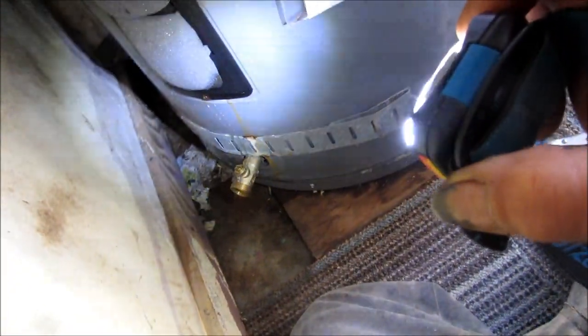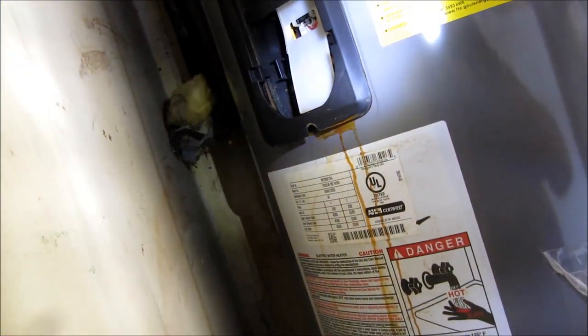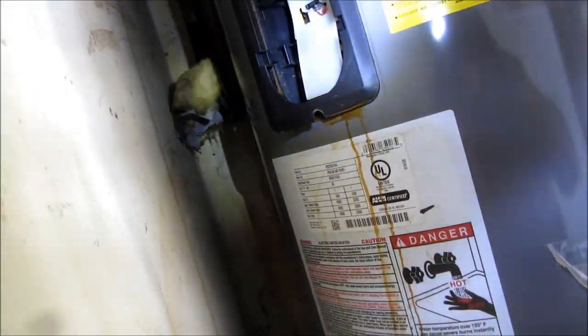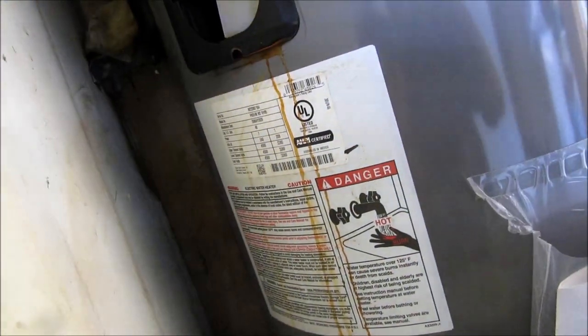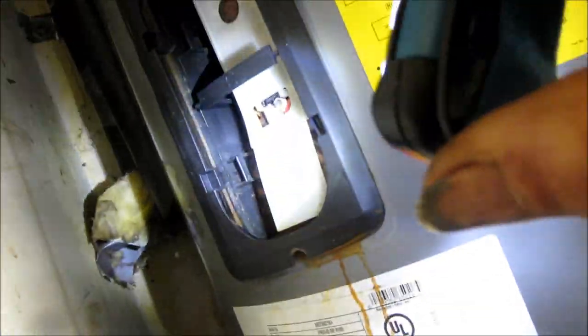This video is for informational purposes only — don't try this at home. There's an electrical shock hazard that may kill you. What we can do is put a clamp meter on and check to see if that heating element is on and pulling about ten to fifteen amps — something like that — depending on the heating element rating. If that's working, it may limp along for a little while, but if that moisture gets up in that switch again, it's gonna blow it. So we got problems here.